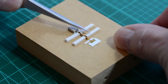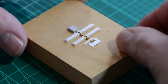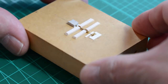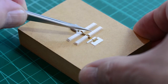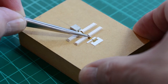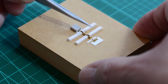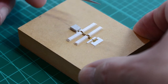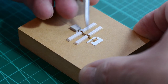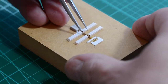So this is again keeping the distance correct and keeping it center lined. I'm not sure if you can see the small surface area there for the solder. So this will also allow the pressing of the soldering iron to hold it down and to apply the heat without moving anything out of alignment. Hopefully the card and paper won't be affected by the heat, but it should be such a short time. It might darken or blacken, but it shouldn't burn. So we'll get on to that next.